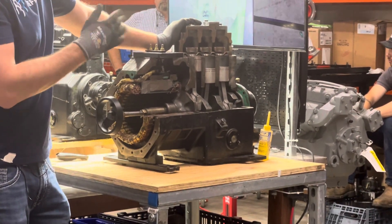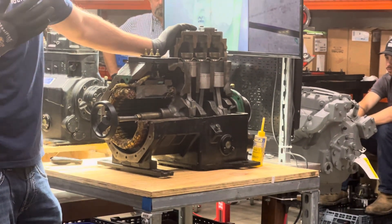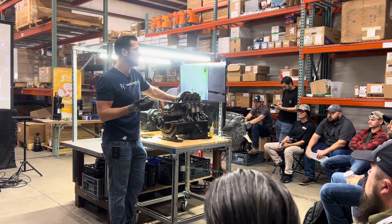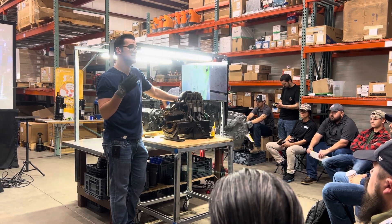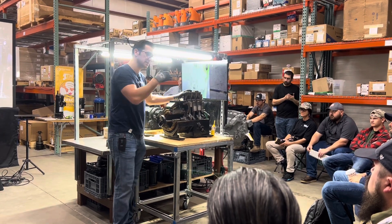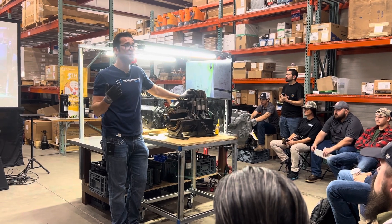There's a module you won't want to put on fixed compressors. Now, if you talk about a Bitzer compressor or a Carlyle compressor, it's the same thing — they have capacity control as well. Mechanical control is really to stabilize your suction and to make the system more efficient. This is a type of mechanical control, just like the digital model, and you can also have variable speed on those compressors.